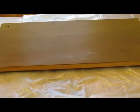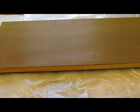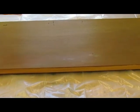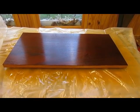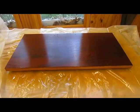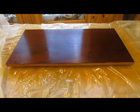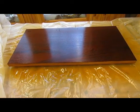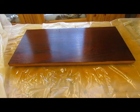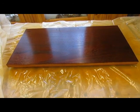I'm not used to brushing shellac — I spray it — so I'm going to give it a coat of spray shellac and see what happens. After I rubbed off the powdery surface with a very fine scotch pad, it evened to a dull brown with some yellow streaks. And this is with two coats of one-pound cut dark shellac. So it brought it back to life — looks like we're on the right track.